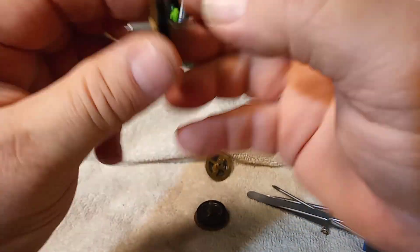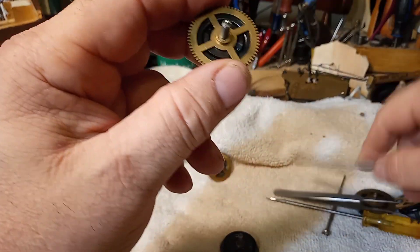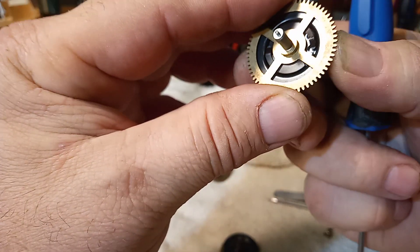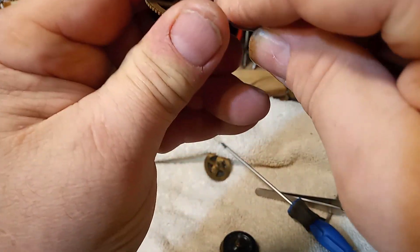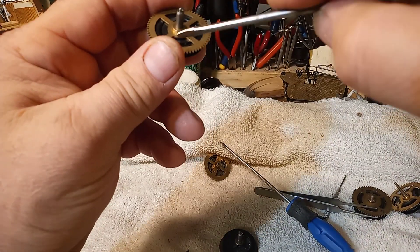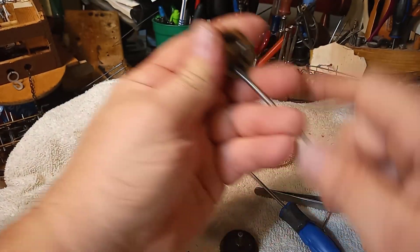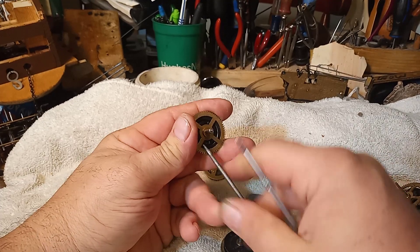Here you have the same setup except it's on a longer pin. Again, you have these tabs that are pressed down to catch the teeth — as you can see it catches the teeth. A lot of times these things are pressed up too much and they don't catch the teeth. You've got two sets — this set over here and this set over here. This set is catching but this set isn't. All you have to do is push this set back down by taking a screwdriver, putting it in as far as you can to the right, then taking another screwdriver and pushing it down.